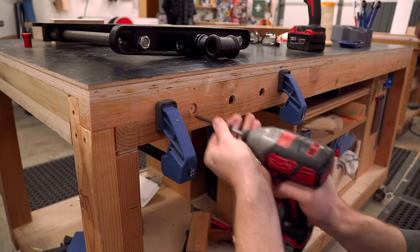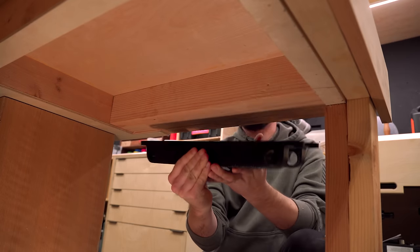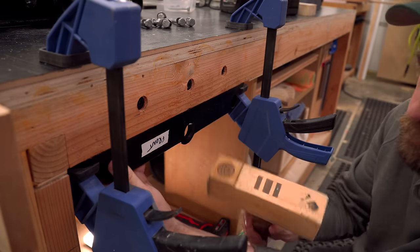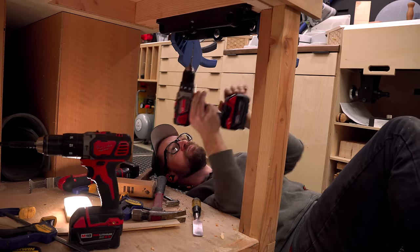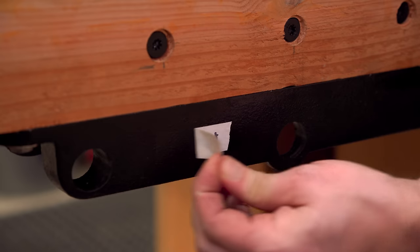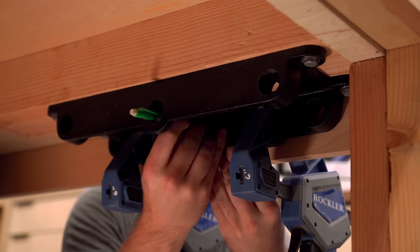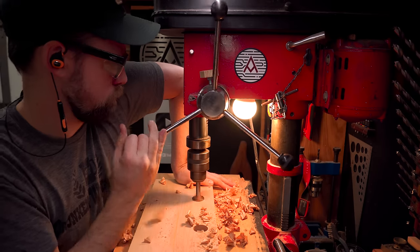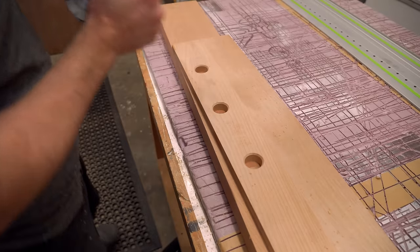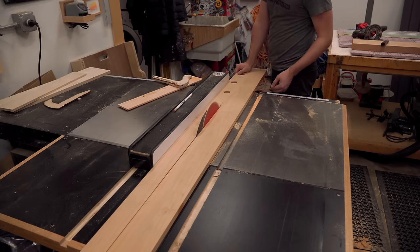I just screw it in and it's ready to go. I could remove the bottom plate from the assembly and this all looks very similar to the last one, but this one turned out to be easier because the 4x4 post didn't have any seams in it so I could mount it flush with the face of the table. Having that plate flush also meant I didn't need to make a template — I could take the side, clamp it on, and trace the holes from the back. As with the other side, I left this one long and trimmed off the excess using the table saw and the bandsaw.